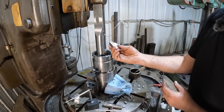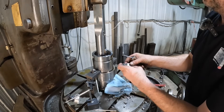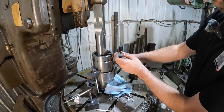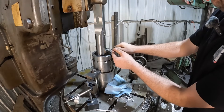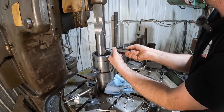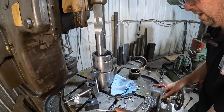We're going to shut that off while we change out the bit. These are a Morrison keyseater cutter, and these generally come about two to four thousandths oversized. So what I did was I just hit it on the belt grinder and took it down. I am now at .999 inches, so I am within the tolerance of the part.